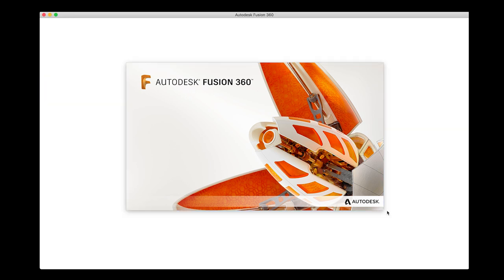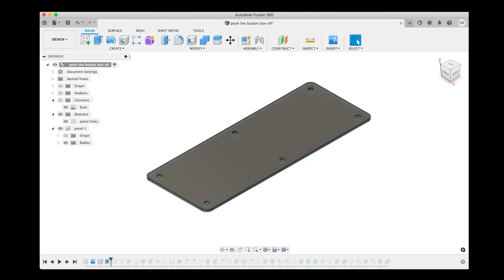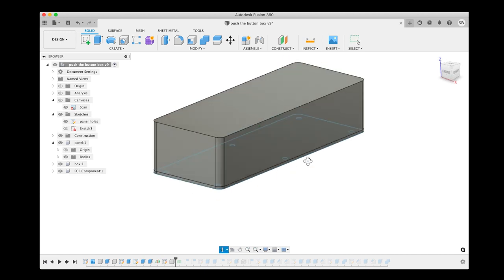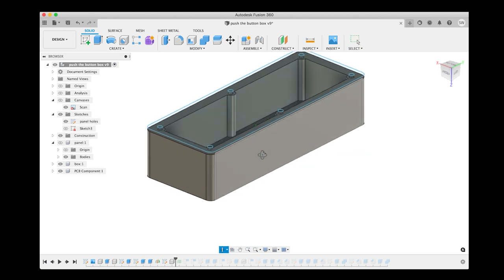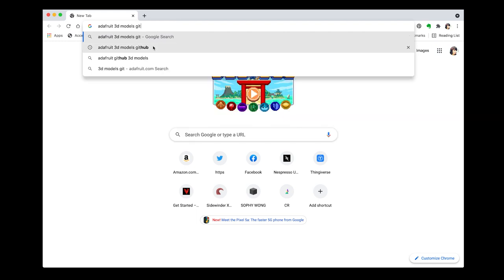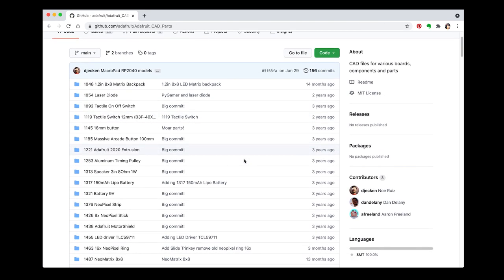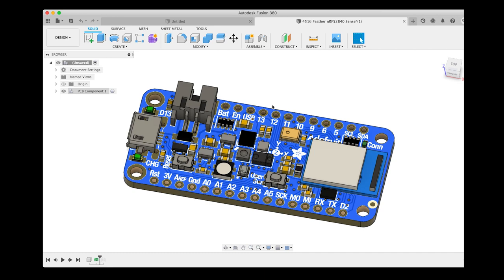To make the 3D printed box, I went back to my scan of the metal faceplate to locate the position of the holes and the outer perimeter. In Fusion 360, I used the scan to model the box so that it would match the perimeter and screw holes in the faceplate exactly. That got me to the basic shape of the box, but I wanted to place all the electronics inside so that I could make holes and standoffs in all the right places. To do this, I used a fantastic resource: the Adafruit CAD files repository on GitHub. This is where Adafruit shares 3D models of tons of their most used products, and you can drop the models right into Fusion 360 for accurate size and placement of parts.